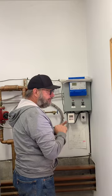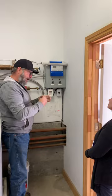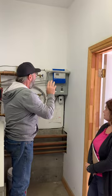Okay. The most common thing for these to go wrong is that sensor in your driveway. Yeah. When I walked by, I said, oh, you got the new one. The new ones are blue in color. The old ones were kind of yellow in color. And what was the most common problem is the epoxy they were built out of. On the 4th of July, they'd get so damn hot, the epoxy would expand and break the circuitry in there. And they corrected it with this one, and these have been out for 12 or 15 years, and I've never replaced one. They're good.